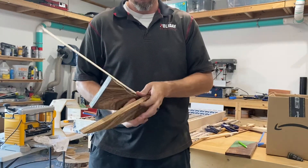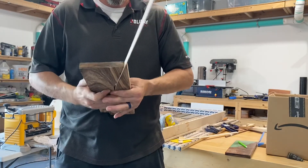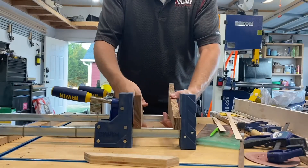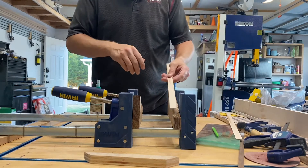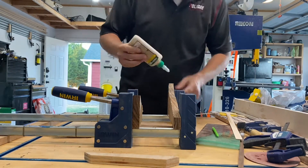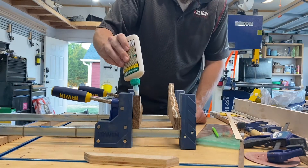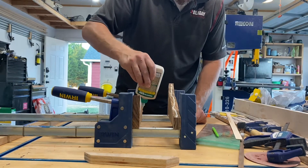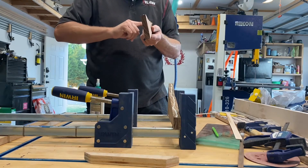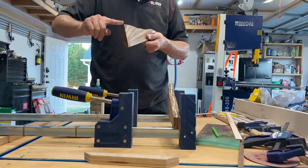Make sure that they fit together like a nice little puzzle piece — and they do. Do a little sanding in between, then make sure my ribbon is going to make it inside. Do a little dry fit, hand pressure — push it, push it — there you go. I like the way it's going to look. Sanded it down a little bit, then let's add a little Titebond III — once again, one of my favorite glues, because it is waterproof.